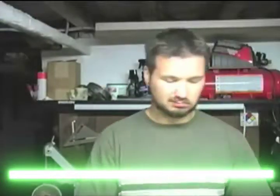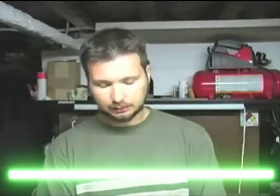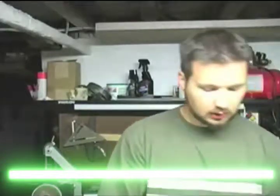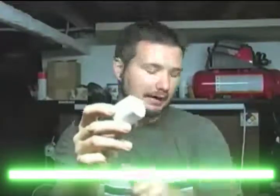Now for our sabre parts, here's what you're going to need. 1.5-inch electrical metallic tubing, or EMT for short, approximately 2 feet of 1-inch PVC pipe, at least 12 inches of 1-inch and a quarter PVC pipe, a 1-inch and a quarter PVC coupling, a 1-inch PVC coupling, about 2 to 3 — just in case you mess up — 1-inch IPS bell escutcheons, if you can find them at a hardware or plumbing store. Find a 1-inch PVC end cap with a flat end — not a round end, so don't buy that one. I'm going to try and substitute this 1-inch PVC adaptor to threaded adaptor here.